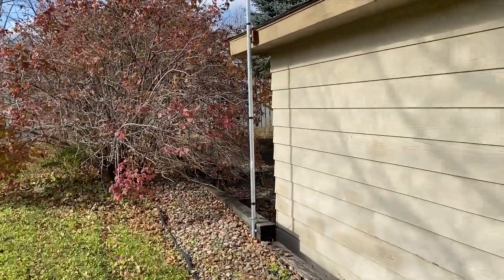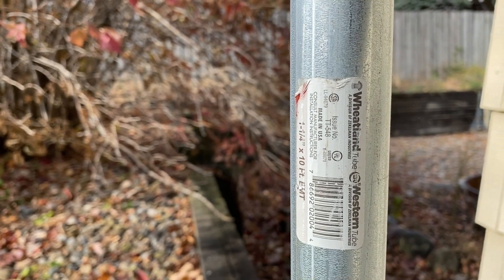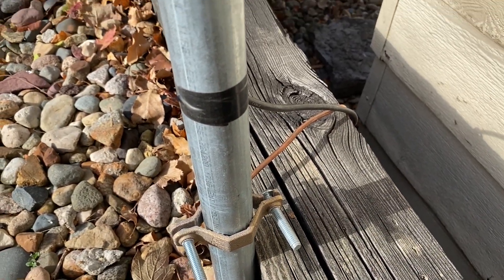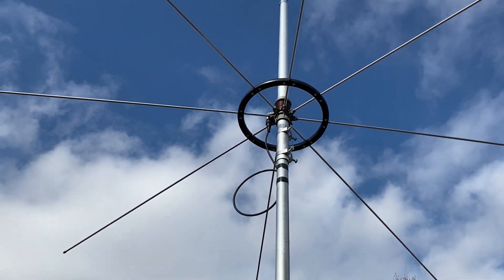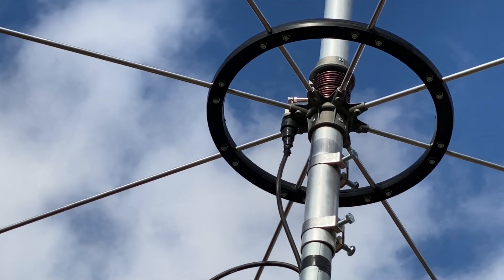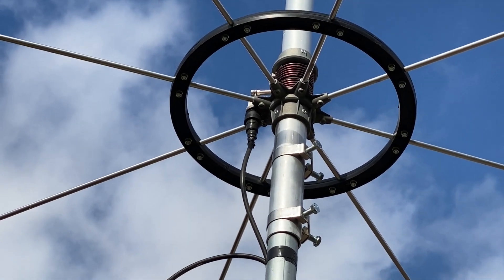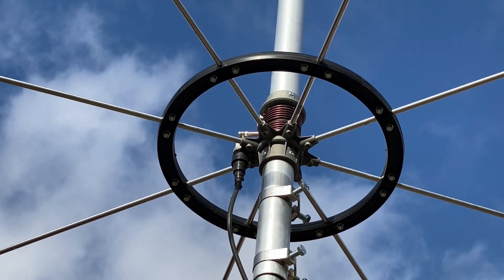We're out in the backyard. This is the pole I'm using — it still has the tag on it. It's actually a conduit, probably one and one-quarter inch conduit by 10 feet. I literally secured it to this railroad tie. I've got it grounded with some number 4 copper wire. The coax is electrical-taped to it every now and then, secured to the side of my shed. And here's the antenna itself. It's just electrical tape — not coax goop, but it is electrical taped. This loop I put in here is to catch rainwater if it starts running down the coax, so you've only got about a foot or so of wet coax. The one-and-a-quarter-inch pipe worked well with the inner diameter of the antenna itself, and you can see those eight ground radials sticking out.